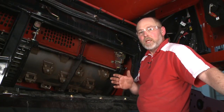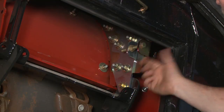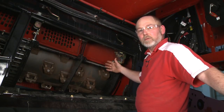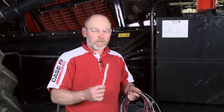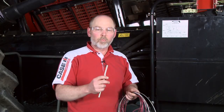If side shift adjustment is needed, we do it over on the right side — there's one at the right front and also one at the rear. We'll use the draw bolt and loosen the clamping bolts, then use the draw bolt to move the carry module frame left to right until we get our side shift measurement correct, based on whether it's a small tube rotor or a standard rotor and whether we want it centered or shifted one way or the other. That's the process of checking and setting concave level and side shift. Making your gauge tools is the appropriate thing to do to ease the job, and a special tool to raise the concave up and down makes it a lot easier. The gauge tool used for level at the front is also used to check at the back — set level first, then make sure the concave is at the correct opening for the appropriate size rotor.